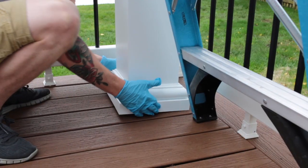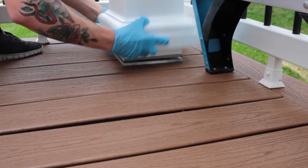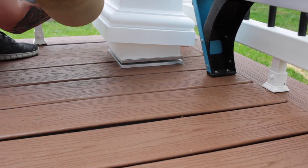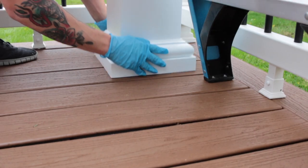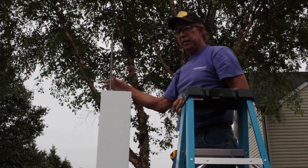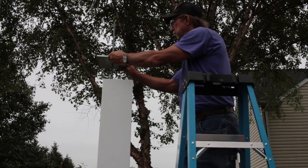Check to make sure the column is resting in the grooves of the column leveling plate. Thread the long rod into the coupler that you added near the base of the column. Once the long threaded rod is tightened into the coupler, add the capital from the top of the column and then add the top mounting plate.